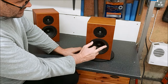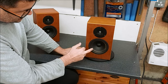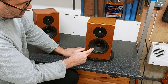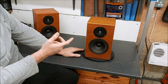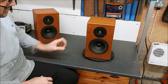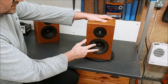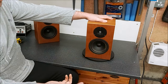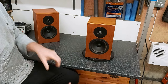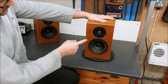I might be able to reactivate the plastic with some heat and a lot of that will come out, but we'll see. The surrounds are really dirty — it is dirt, I'm pretty sure of that — and that's made the suspension very stiff. When I do near-field bass measurements I can see it's a bit recessed. We'll give these a really good clean, treat the rubber, and hopefully get these free and moving again, because otherwise both woofers measured really well with no distortion. The issues, as far as we know, are in the tweeter.